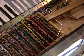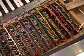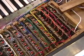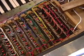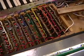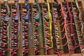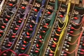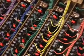Again, now let's go over what you found. All right. Well, what we did is we had a flip-flop that just would not trigger properly. We thought it was initially the transistors because the ones from this era do eventually come up with a symptom that is equivalent to silicon dry rot. But in this case, it didn't turn out to be the transistor.